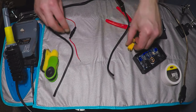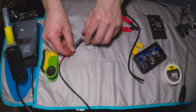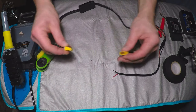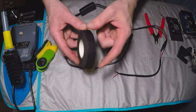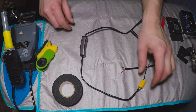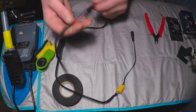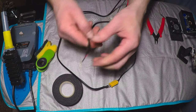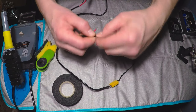I'm going to cut this cable halfway through and join in an inline fuse. I've got the end on there to the connector, and these are going to be taped up with a bit of wiring loom tape — harness tape — onto the switch, going down to the fuse. I'm going to tape these together and that's going to go in the box, and then it should be virtually done and dusted.